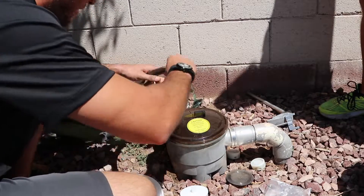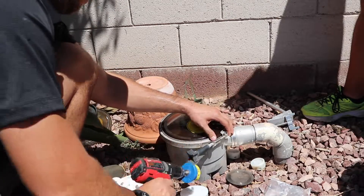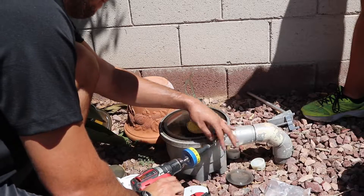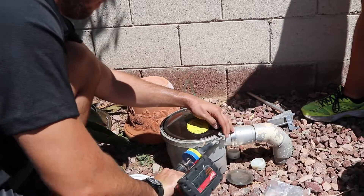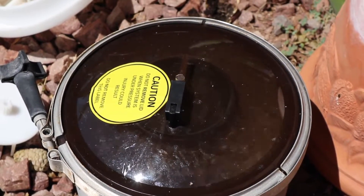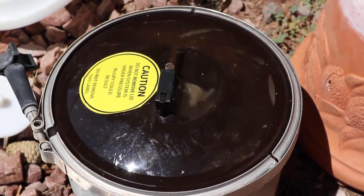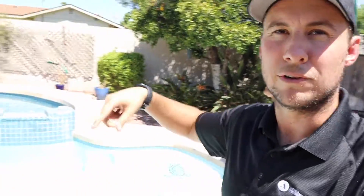So there's the speed control. You don't have a new clamp, but that's all right. So when you put the lid on everything — with a brand new water valve that's just been started up, you're going to see a lot of air in the system. We had all the zones open, so it needs to rotate around to all the different groups of heads to flush out that air.